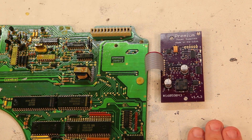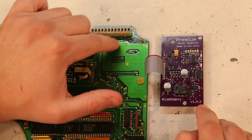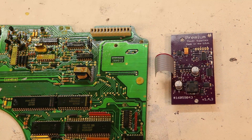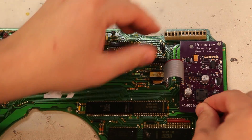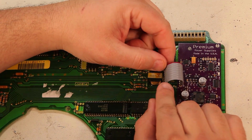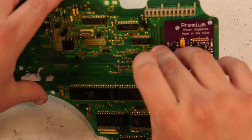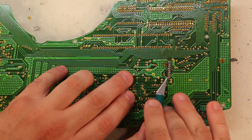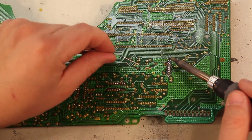The Royal Premium Power Supply is designed as an exact replacement for your factory power supply. It has a new set of plastic clips which align exactly with the holes in your cluster motherboard, and it comes with a replacement ribbon cable which is pre-soldered to the power supply. To install the new power supply, we'll snap these two connectors into place. Then we'll take the factory ribbon cable — the red wire goes to pin one. We'll align the cable so that one wire goes through each of the eight holes, then we'll turn it over and verify that we have one wire in each of these eight holes. We'll take our soldering iron and the supplied solder and solder this cable into place.